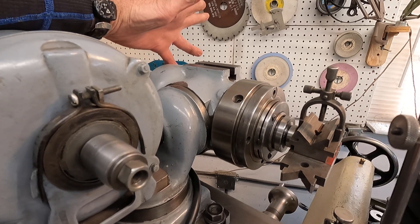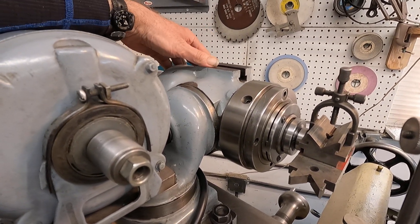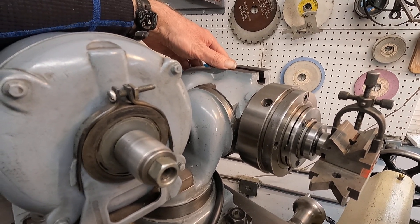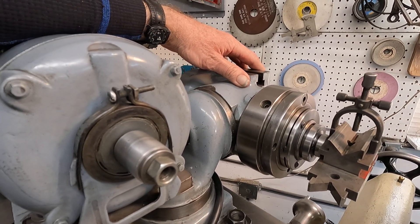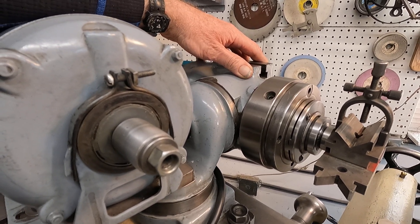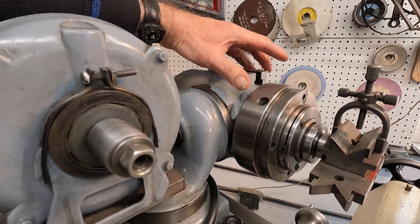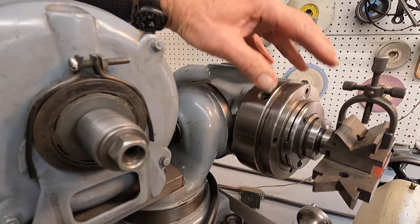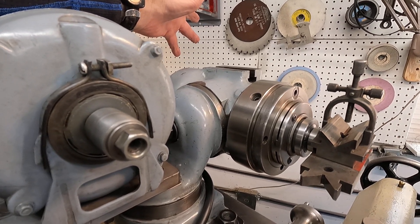This workhead has to be more precise than that mill spindle. What I found - and others too - is if you take this apart and take the bearings out, put it back together, it's not going to run true. The factory assembles these with Type Zero bearings and then grinds the tapers in the bearings. You've got to think about that.